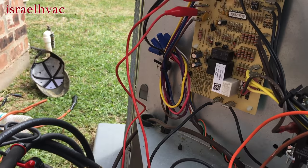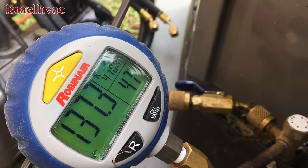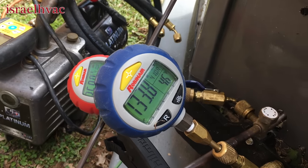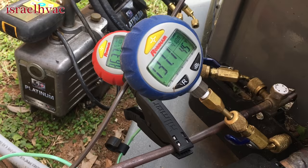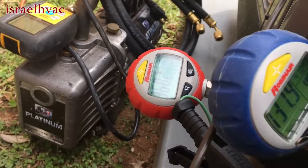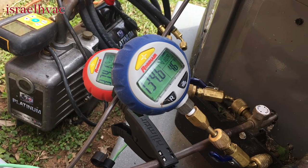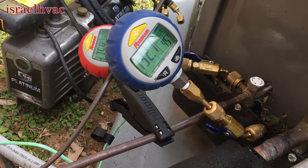I've put a jumper between red and B — B is the reversing valve on the Rheem and Ruud. We're definitely not pumping down anymore. The suction pressure is holding steady. Head pressure is climbing — it's about 65 degrees out here, so that's not out of the ordinary. Before this repair, when I'd run it in heat mode it would just immediately pump down — about 10-15 seconds and it was pumped all the way down. So it looks like our repair is successful. Head pressure is at 366 and climbing, which is not out of the ordinary. I couldn't really get my sub-cooling above 3 degrees, but that's because it's kind of cool in the house, so I'm going to warm up the evaporator and then drop it back into cooling mode.